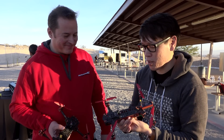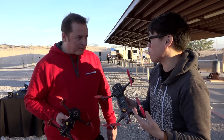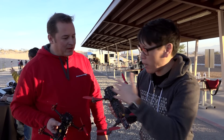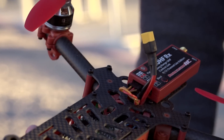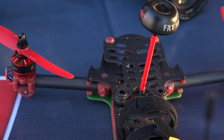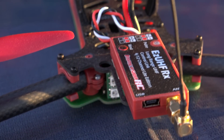You're making all the components here. If someone were to build their own quad, they would occasionally use your ImmersionRC transmitters for video — that's what you guys are known for. So what have you packaged into this kit? We've packaged a video transmitter right on the base board, all integrated. We've packaged a flight controller and an OSD on a jello-proof vibration-free board. We've built ESCs into the arms — tiny ESCs, about 9 millimeters wide, 12 amp ESCs.